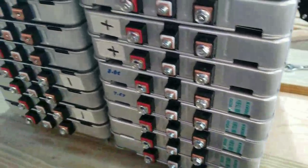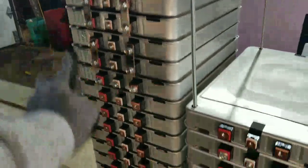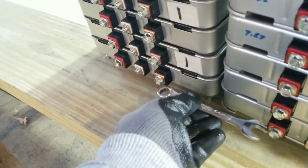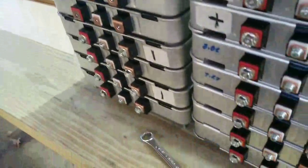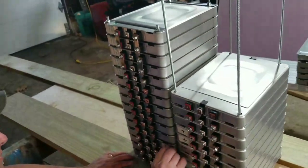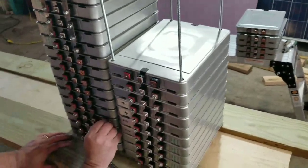So positive from here and negative from here — that's how we're going to draw the batteries. You have to draw from opposite ends. After we parallel these, if you put anything from this end, it's not going to arc anymore. Positive to negative — that's how you're seeing this battery bank as one. It's all negative on one side, all positive on the other. One wire or bus bar right here — you already see this: 15 batteries on each side, drawing from one end to the other. Like and subscribe — JW Solar USA, thanks for watching.